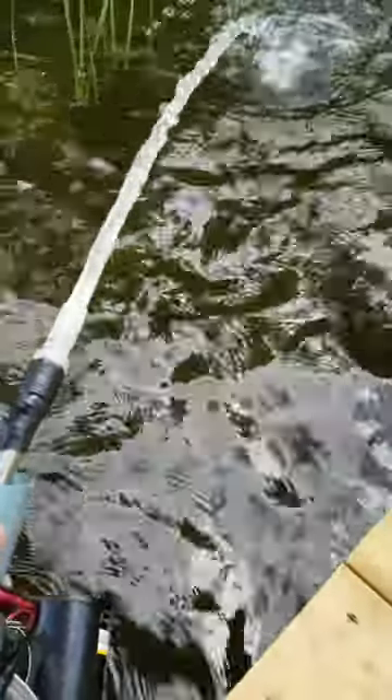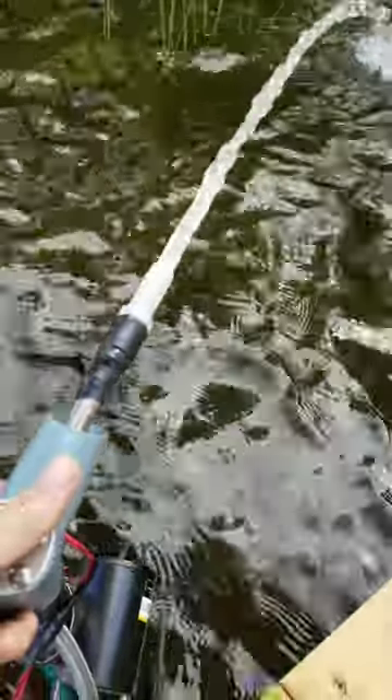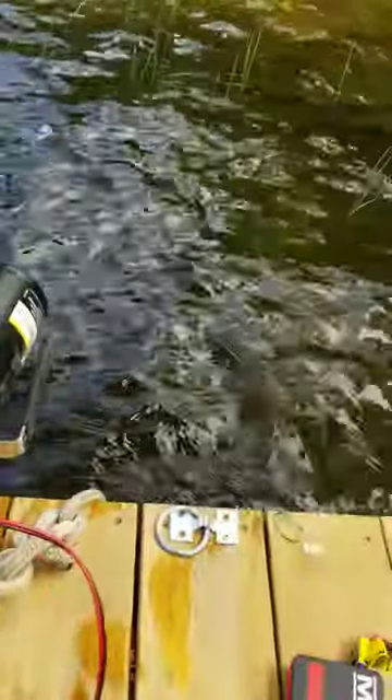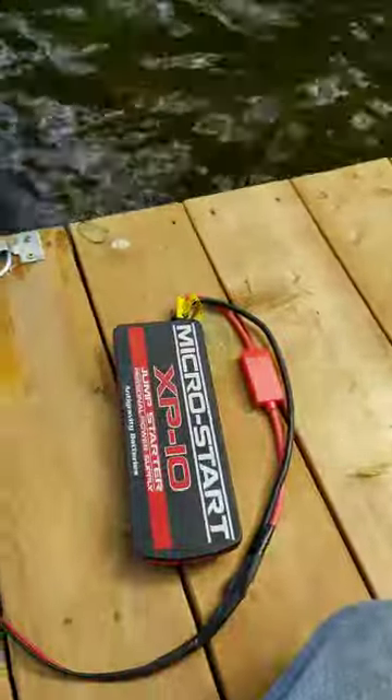I also use this pump in wintertime for pumping water out of the lake, which is a bilge pump on the bottom — that works fantastic for that purpose. However, a bilge pump will not draw water up an empty water column like a pipe, which is needed in this case. So it's very handy and very easy to make.